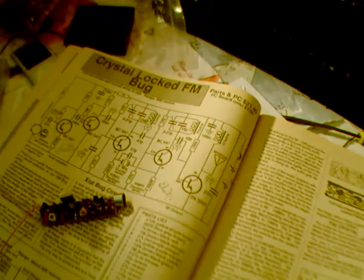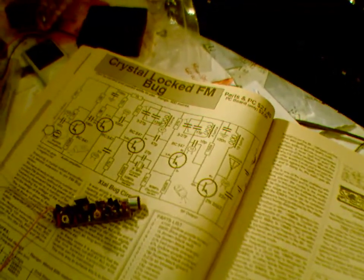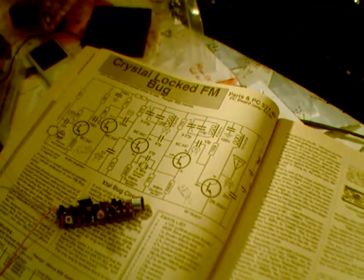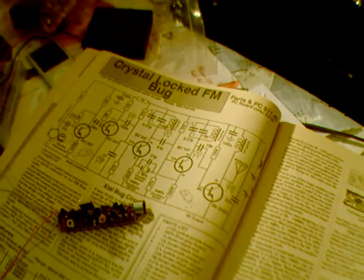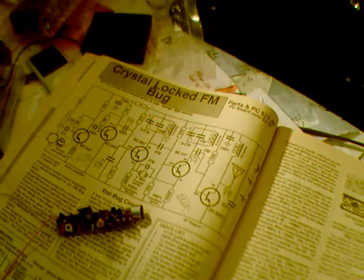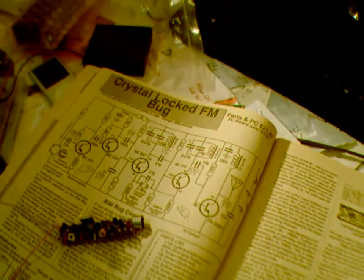You can find power supplies with 12 volts in, and you might get 20 or 30 volts out at, say, an amp or two, and that would be fine for driving an IRF510 amp at higher power. I built one. I haven't had it on the air, but I built one. I think it gives me about 15 or 20 watts from an IRF510, and that's with around 20 or 25 volts.